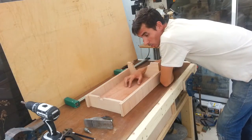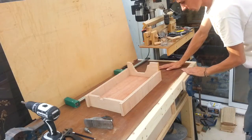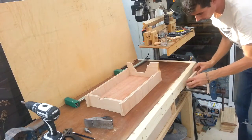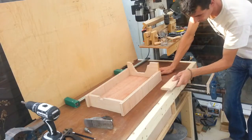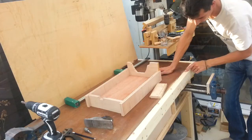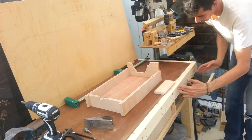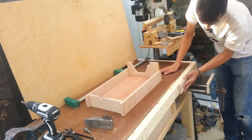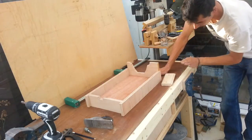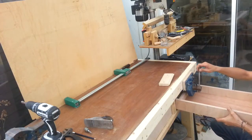I've taken the new small drawer out of its clamps and whilst that's been drying I've been playing around with the cheek on the inside of this part. I've removed the old maple cheek that was on there — it was too low anyway. I've taken that off and used a piece of 4x2 and cut that out on the table saw with a rebate to fit around the back of the vice, so I've got a nice cheek that flows. What I'm going to do is plane down a piece of hornbeam slightly longer and fix that across so it's a little bit wider, and then have a new slightly wider outer cheek to fit the vice — but at least now I can use it.